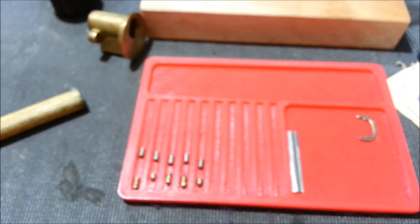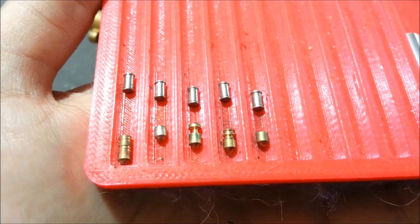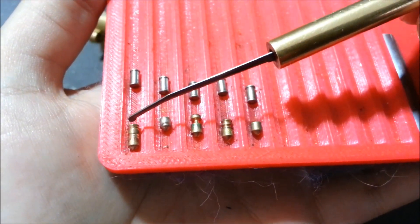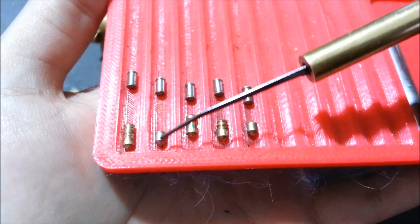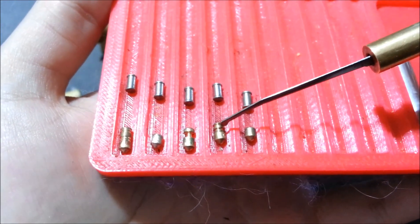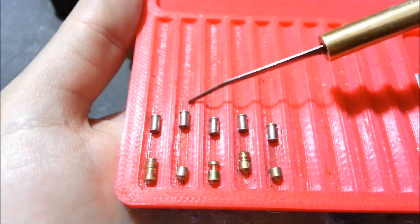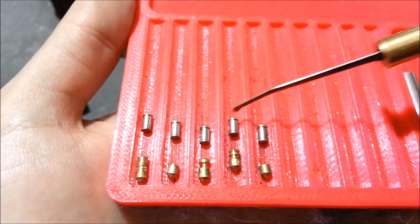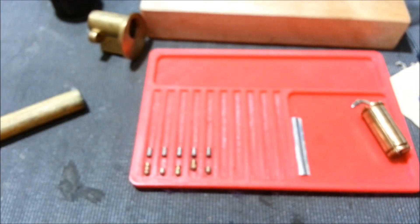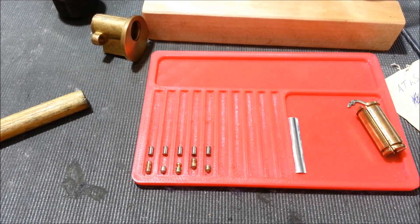The core is smooth. The pins are not smooth. Nice serrations on number one — four of them. Standard number two with a taper. Nice spool here — you overset that and you'll be stuck on it. Same with this guy here — serrations, nice deep one there. And a standard. And up top we have the famous Lockwood shallow-lipped spools, which are a fun of their own. Great work, Paul — I'm glad you reminded me about this lock and I was able to get it picked. We'll be able to send it on to the next victim — I mean, picker.